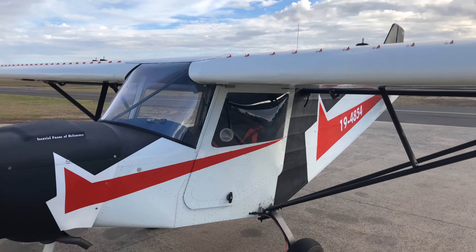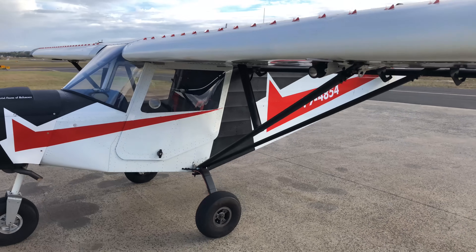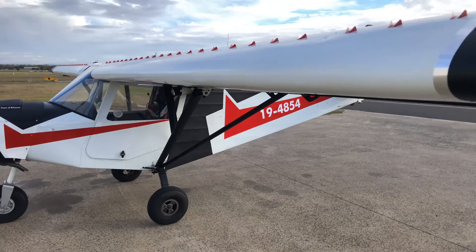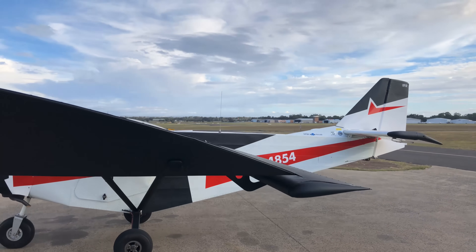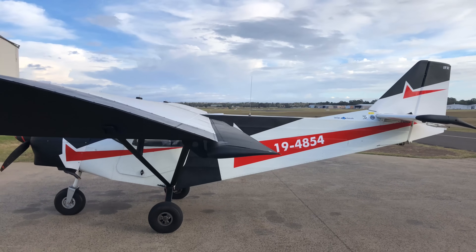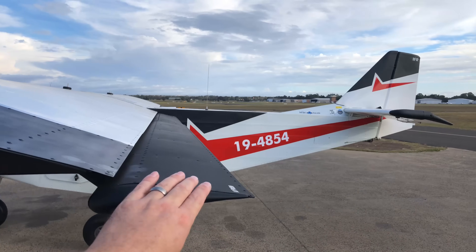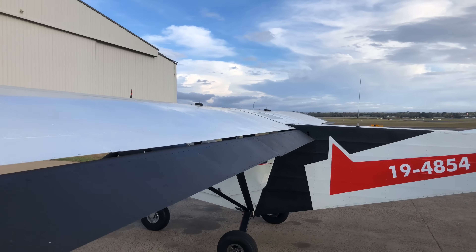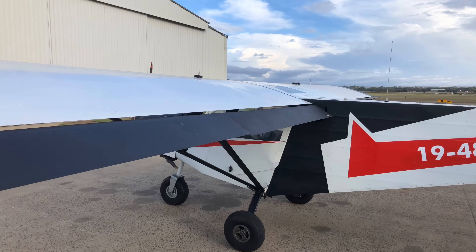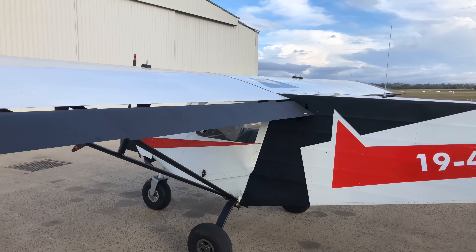Cruise is 85 knots, so it's not the fastest thing, which is great for your logbook — but 85 knots is no worse than a Cessna 152. Here's that wing profile. We have a stall speed of about 25 to 30 knots, approach speed at 40 knots, and can land at 30 knots quite easily. As you can see, we have full-span flapperons — both flap and aileron — which give fantastic low-speed control, especially in the high angle-of-attack regime, because you still have full airflow over those ailerons at high angle of attack.